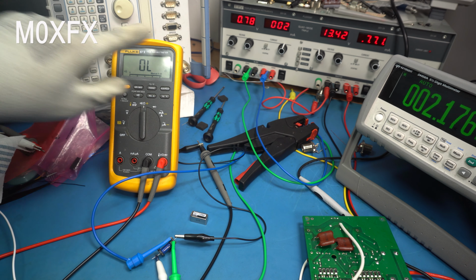And if I bring the camera over, you can now see the modification. I've had to cut the tracks in two parts so I could separate the power. But this is the diode, and this is the 13.8, which is feeding that big switching transistor. And obviously the diode's dropping the voltage to that pre-biased switching transistor. I'm going to put a bit of hot melt glue on there just to dab it, to stop vibration. But that is switching beautifully, and I've checked the voltages, it's good.